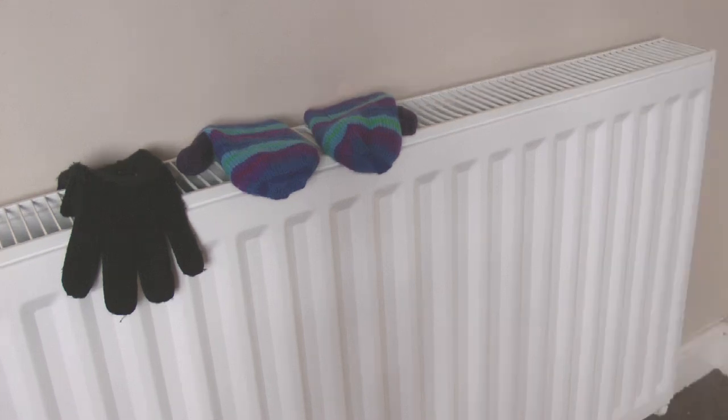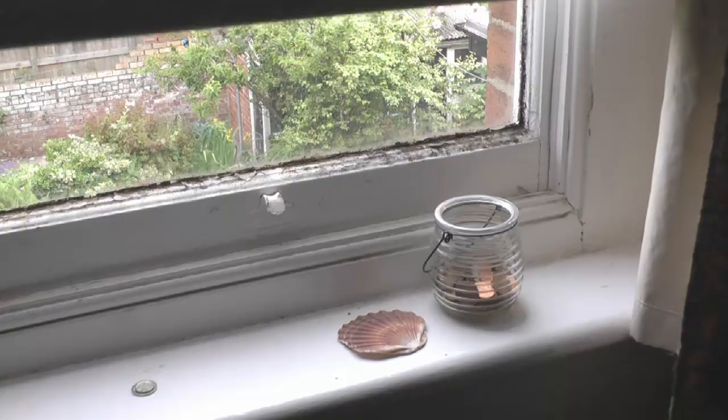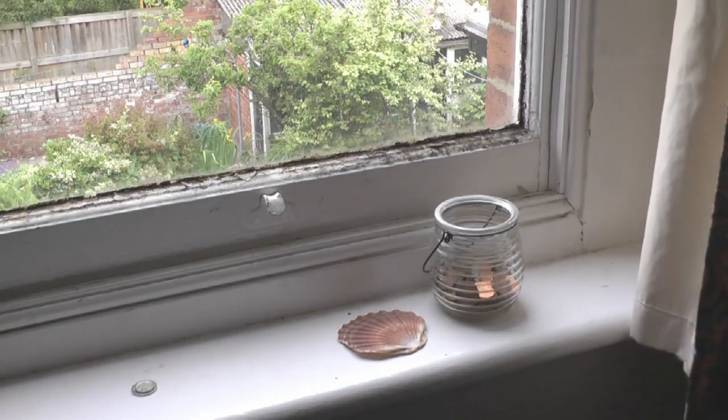This programmer is battery operated and wireless so you can put it anywhere you like within your home. It's important though not to put it anywhere too hot like near a radiator or fire, or anywhere too cold and drafty, so not near any doors or windows.